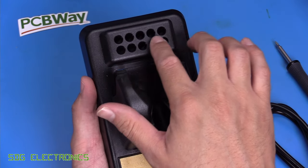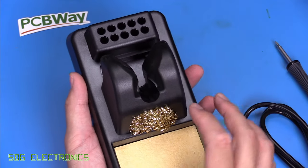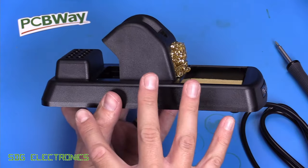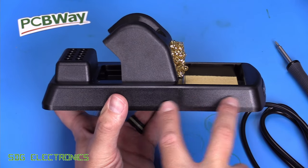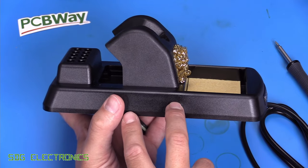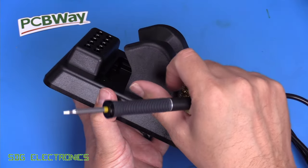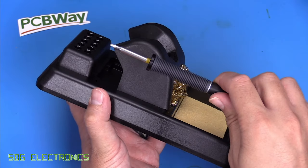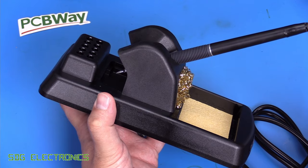At the back there are 10 spacers to store cartridges, similar to the Metcal. The differences are that this cradle is much larger, and on the Metcal you can remove the sponge area and slide it underneath. Also, this cradle has a fixed angle, whereas the Metcal has a thumb wheel to adjust the handpiece angle.